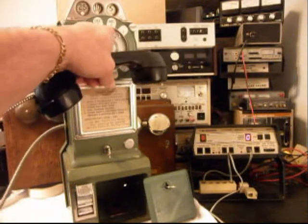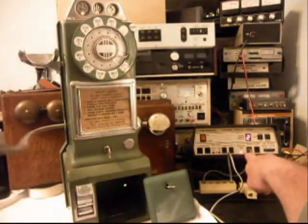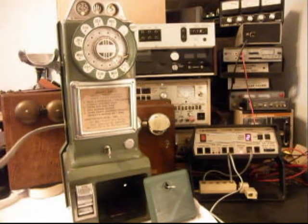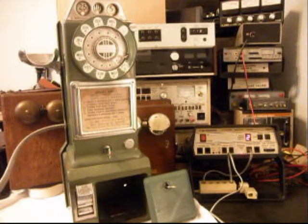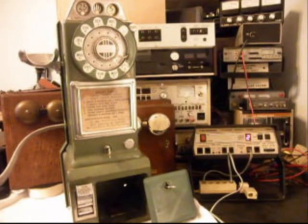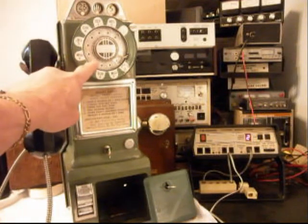and we'll dial a 2, and we want to transmit into the handset. So if you watch this red light on the analyzer, every time we transmit into the handset, that's an indication of 100% modulation every time you see that red light. 1, 2, 3, 4, 5, 6. Hello, hello. So we know that this telephone is dialing out.